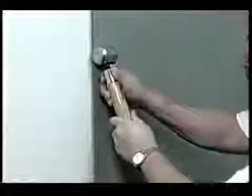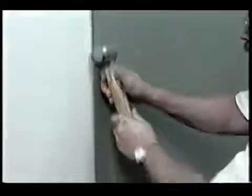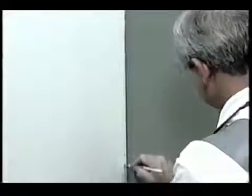Cleaning the excess adhesive from the wall at the seam edge is critical to avoiding any adhesive buildup, which will result in an uneven surface, also known as ledging in your seam. Use a rag dampened with slightly soapy water or just a putty knife to thoroughly remove any excess adhesive from the edge. Cleaning the final exposed edge isn't as important, as generally you'll want to finish it off using wood or plastic trim. For the second piece, we're going to demonstrate the pattern scribe method.